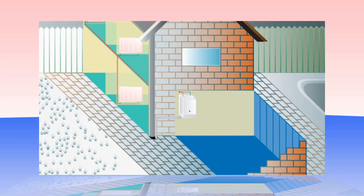There are a number of solutions you can use, the simplest of which is to insulate the condensate pipe with a waterproof and weatherproof insulation around the outside of the pipe. This is available from DIY outlets and plumbing heating suppliers.